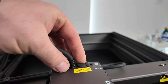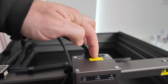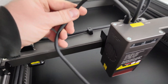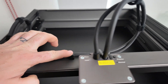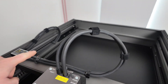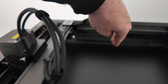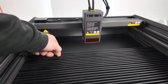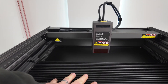Now that's installed, the next thing we're going to do - we've popped this little cover off here, this is where our air assist tubing goes. So we can unclip that from here and straight into the laser module. With these little cable clips we just lift these up and push the cable in. We're now going to re-route the cable that it comes with, which is going to plug in here. I've run it through and wrapped some of these velcro cable straps around just to support it and make it look a bit nicer. The next thing is to put our honeycomb base in - those little steel fins slot into grooves either end to create our base to cut on. That is our cutting bed in.